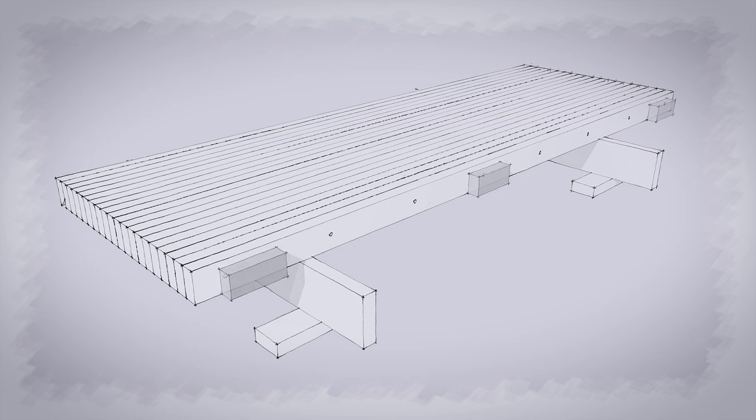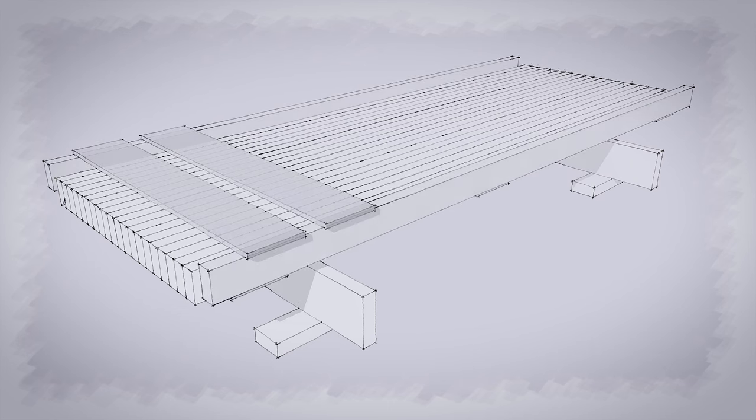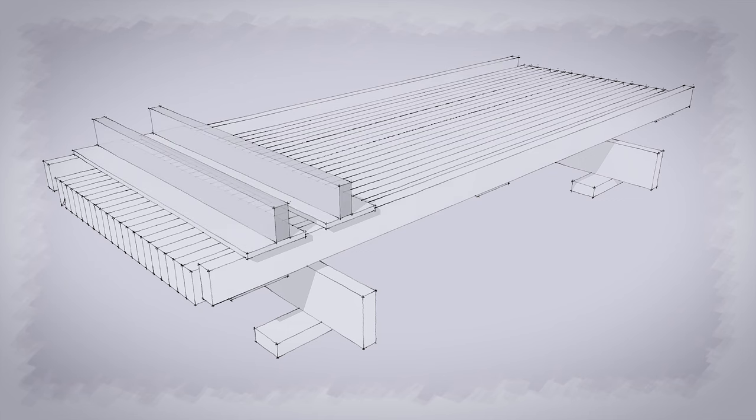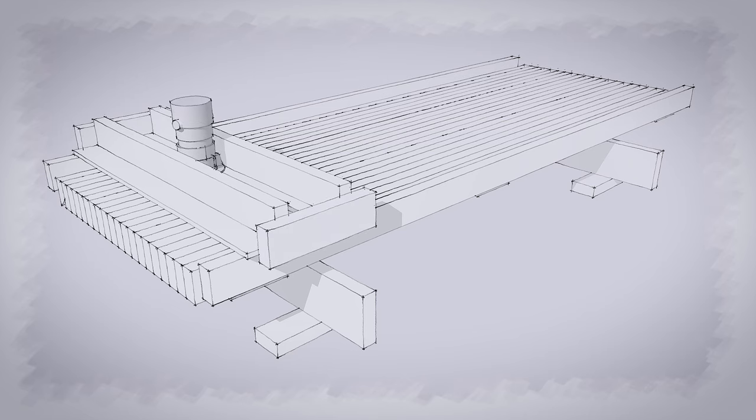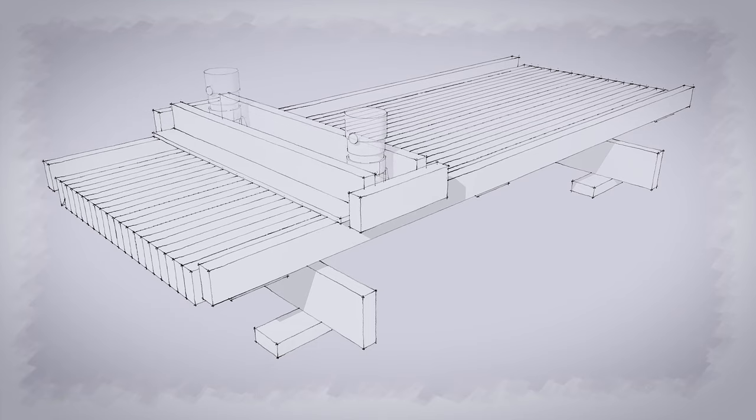Now that the top is all glued together, it is time to get it level. I'm using some 2x4s that are nice and straight, some MDF, and some other 2x4s to make a routing sled. And I have to stress, use good quality straight material for this, or you'll ruin your top.